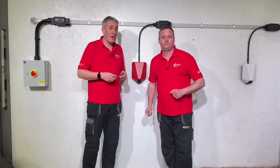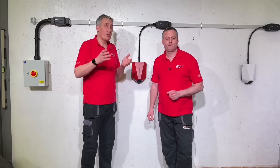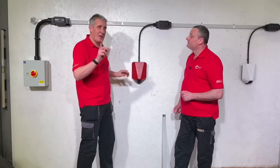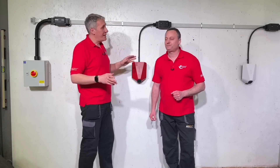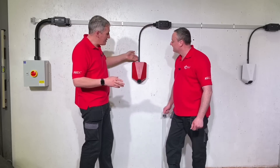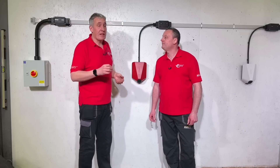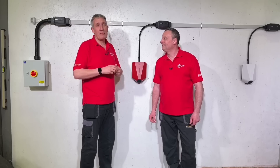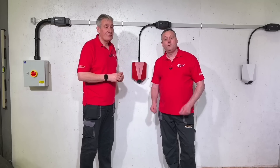This system allows you to flexibly deploy those EV chargers. What we've got here is this flat cable — the best way to think of it is just like a bus bar. You run it around the car park and then add tap-off points which go down to the EV chargers as and when you need them. This delays some of that initial investment but means you can quickly add a charge point when somebody gets an EV.